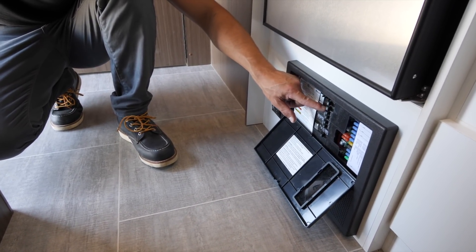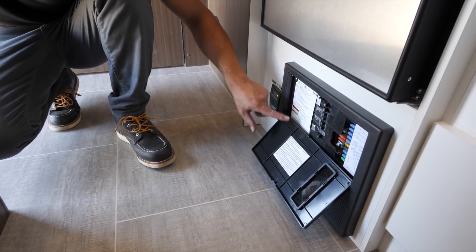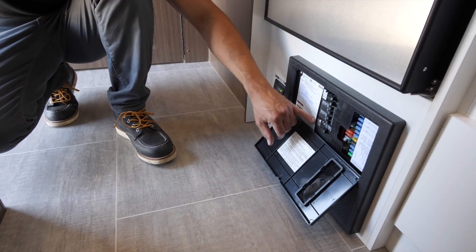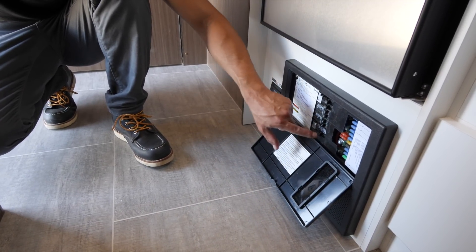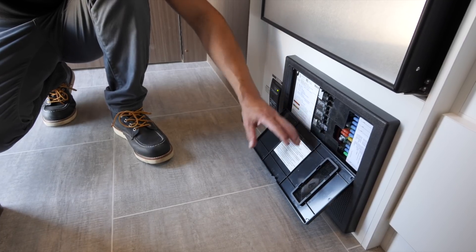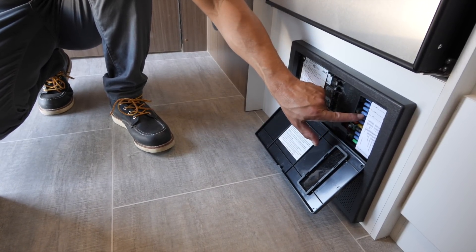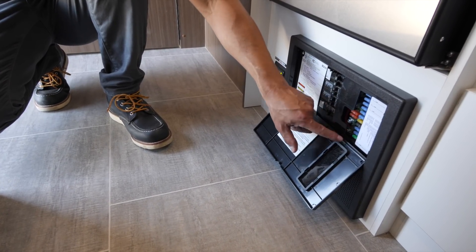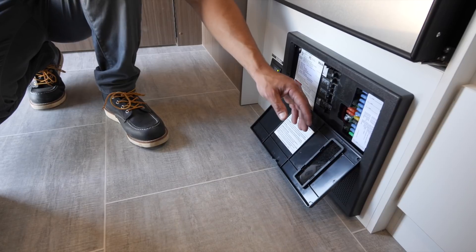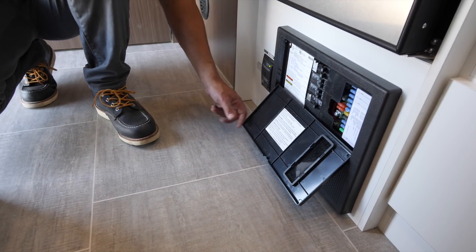This unit houses the electrical breakers: a 30-amp main coming in, distributing to various 20 and 15-amp outlets, all labeled. There's also a GFCI-protected circuit for the bathroom, kitchen, outside outlets, and refrigerator outlet — all wet areas. If one trips, you reset it right here in this compartment. The converter changes AC current to DC 12-volt power for lights, fans, the radio, and the water pump. The DC fuses range from 15 to 40 amps, all labeled, and each has a red LED light that illuminates if a fuse blows so you can diagnose and replace it with the same size.